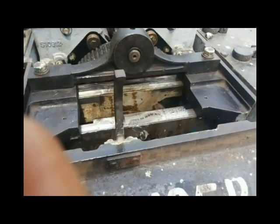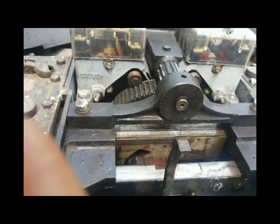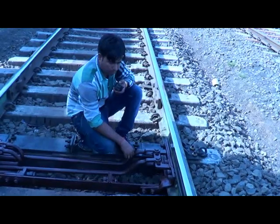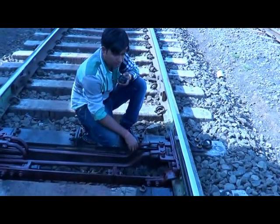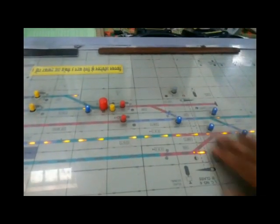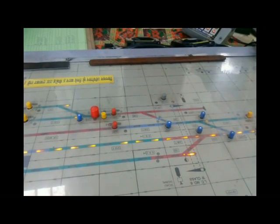Detection Test with 3.5mm test piece. The lock segment shall enter into the lock slide notch, but detection contacts shall just break, indicating a point fail condition. Point failure indication is shown on the SM panel at the station.